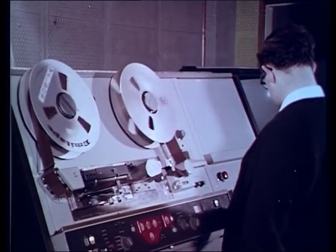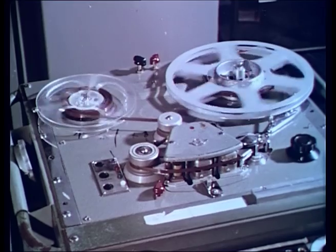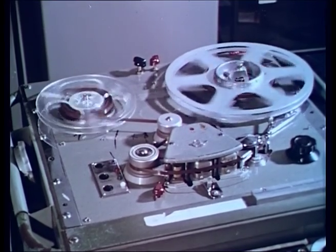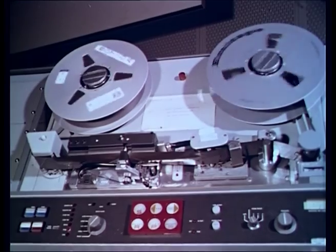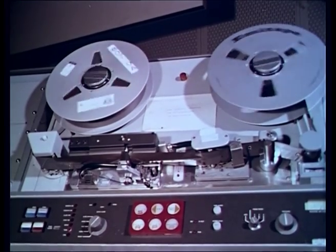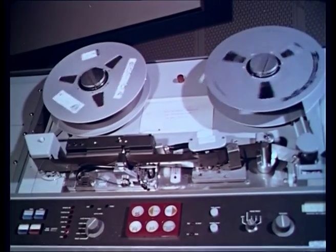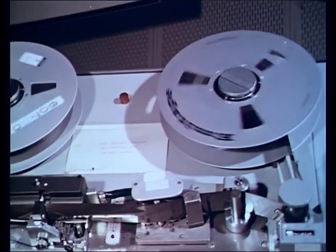Videotape recording uses, in principle, the same methods as an ordinary sound tape recorder, which puts an electronic signal onto a piece of oxide-coated tape, passing at a given speed over a recording head. In appearance, the VTR machine looks like a vast sound tape recorder. The tape it uses is much wider, 2 inches in fact. And it runs through the machine at about 15 inches every second.